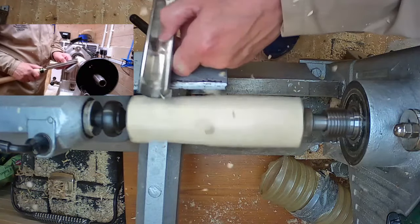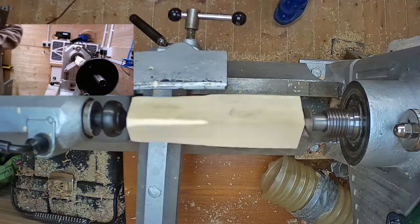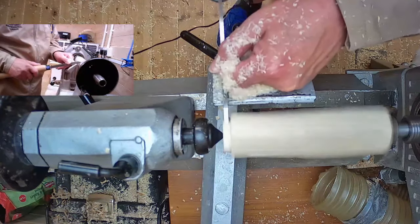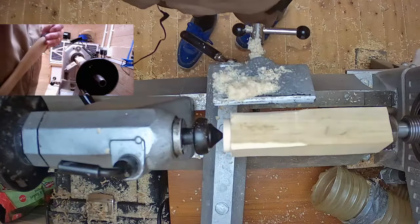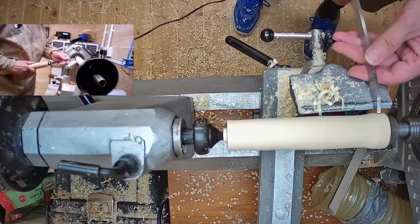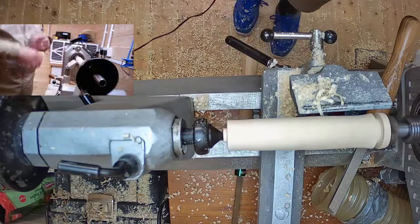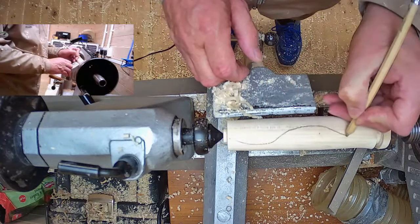A cut slide off — that's a way we do it very often. A parting tool, standard grind, standard parting tool — no problem at all. So that cuts it off. Just move it over, mark the other end where we go to part off again. Don't want to go too close to the four jaws, so that's given us the overall length.